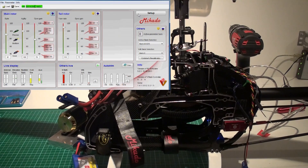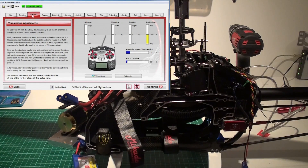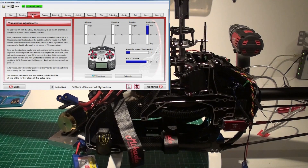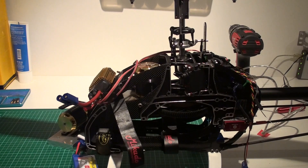I also want to check one thing — going into Setup, I want to go into the transmitter and stop that annoying beeping. And I want to check that I have a 0 to 100 throttle curve. In this case I didn't have it — I only have 87. So I have to adjust my endpoints. It's because I had a preset curve that wasn't reaching to plus 100. So I'm just resetting the top one to 100. Now it's reading 101 — that's okay, 1% isn't that much off.